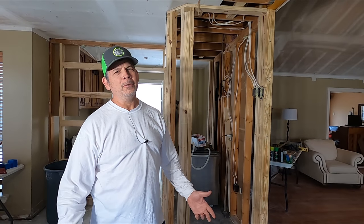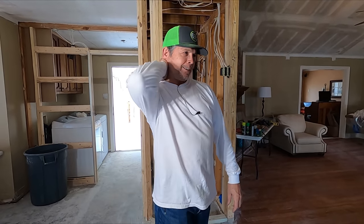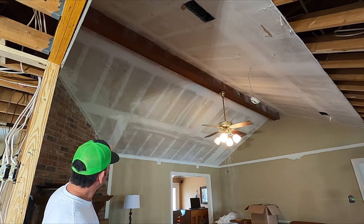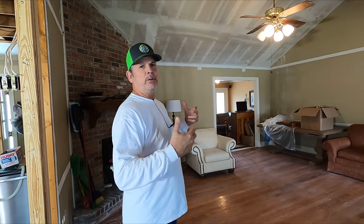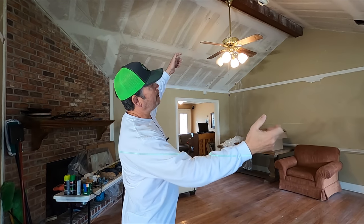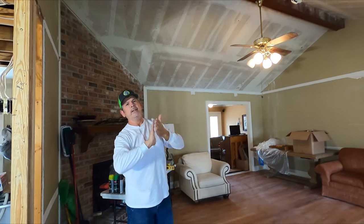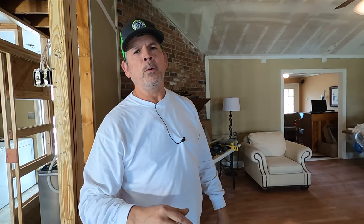It's the next day. We've mentally recovered from scraping the popcorn ceilings — I'm not quite physically recovered yet, my neck's still a little jacked up, but I'll be all right. It came out great. I will say there are a lot of nail pops and several cracks in the butt joints. We're going to fix all that. I've always wanted to try those new wide skimming blades — you can get a 32-inch blade by Level 5. The plan is to make a pass and skim coat the whole thing nice and smooth with topping compound. Let me know if you've used those before.